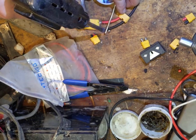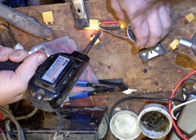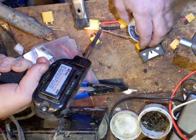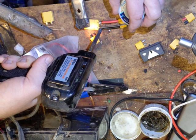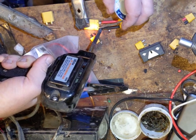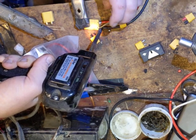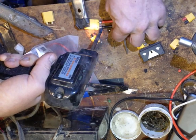It's not a great joint, but as long as you've got a solid electrical joint you can clean up the mess later. Same thing with the next one — you can kind of push because those connectors have that raised side on them. Just trying to get our tip hot here. There are two screws up here; if for some reason that tip is loose, you can tighten them up.